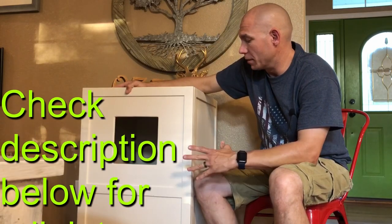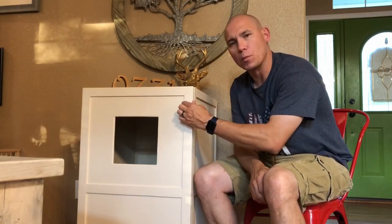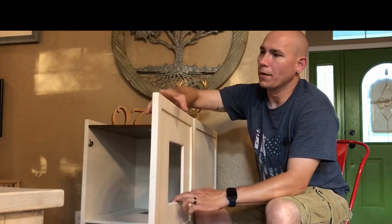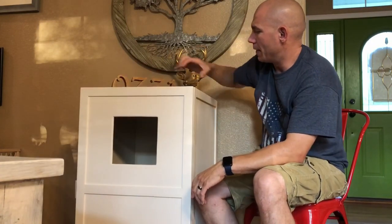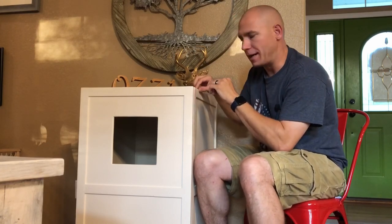What you're going to need to build this with is half-inch plywood — that's what I use for the shelves, sides, door, everything. I ripped down some one-by pine. This is pine plywood, sanded CD plywood. It's like a third or fourth grade plywood — you're going to have big holes and stuff in it. You don't want that. Get that sanded plywood and go ahead and spend that extra money. I did use some edge banding that you iron on to hide the edge of the plywood door and on the front edges. It hides that layered edge. On the sides, I cut rabbets in the trim pieces and that overlaps on top of the plywood, giving it more structure and a better aesthetic look.